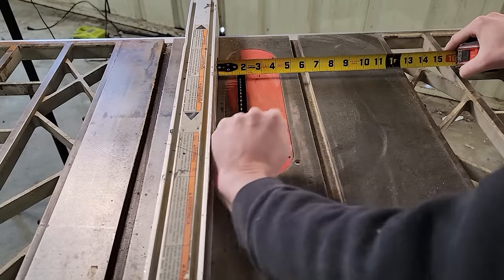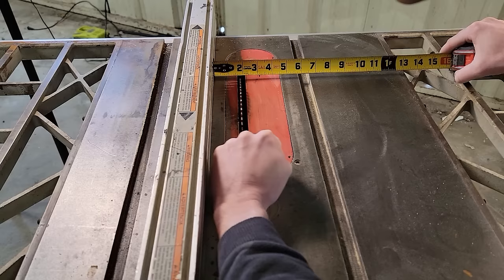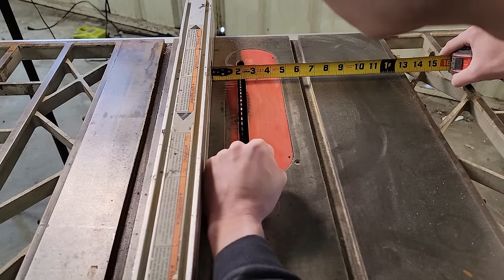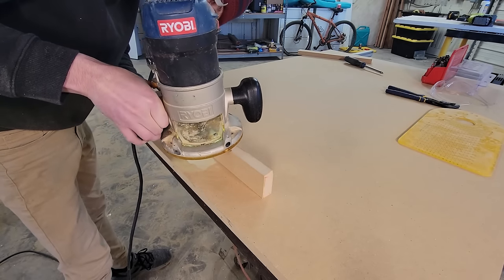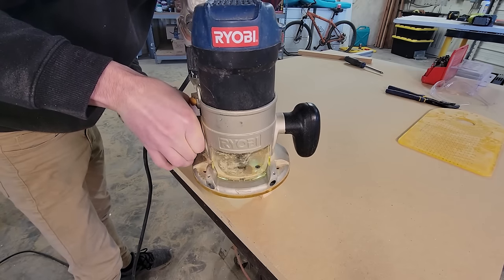So I'm at a point now where I need to think about bracing. My plan is to brace directly below the driver and in the cavity created by our port extension. With three of our panels being double thickness, we really don't need to go crazy here. It's also important that we don't obstruct the port opening inside the enclosure. I'm going to rip the bracing material and then give it a round over before gluing into place.